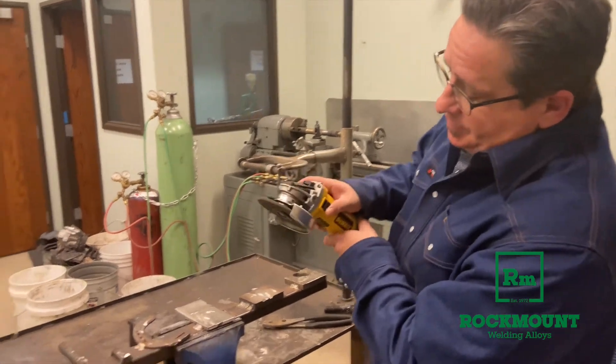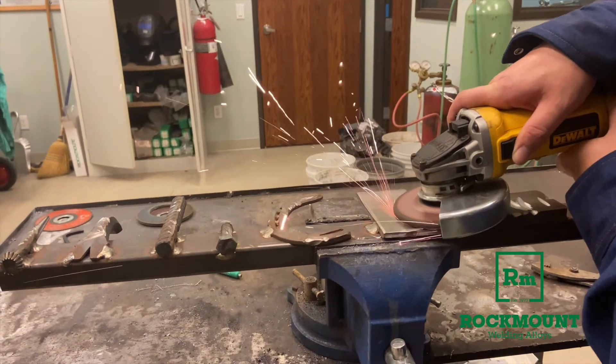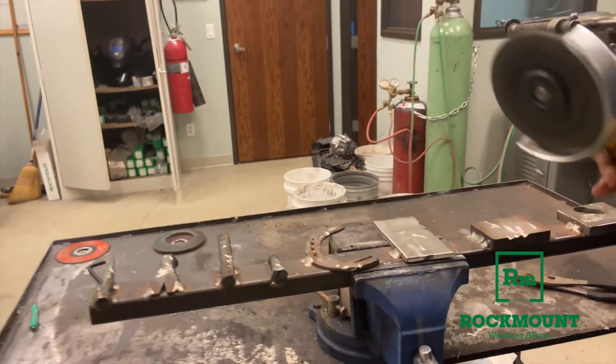Not all stainless steels will look shiny, but sometimes they're stainless steel and you want to determine that. You can do so by doing a spark test as well. What you saw when you do a spark test on stainless steel is very few sparks. That has to do with the high nickel content in the stainless steel. It's a hard material so it moves less material, but very few sparks and a little bit of starburst on the end. That can help you determine stainless steels.